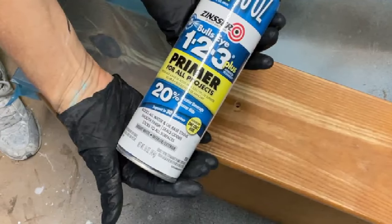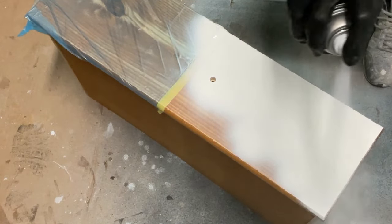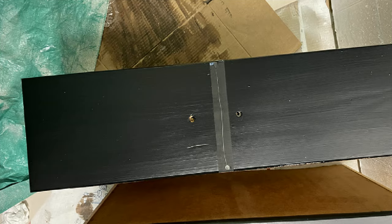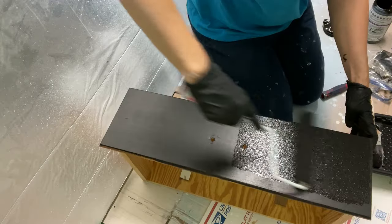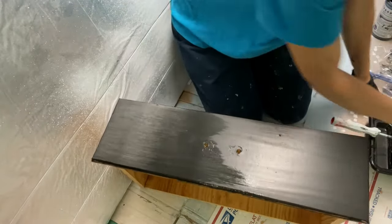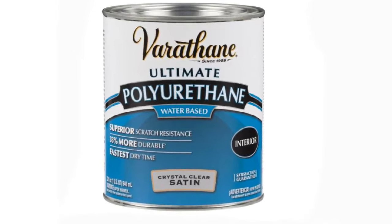Drawer number five was used for the chalk paint. Since Beyond Paint is an all-in-one paint with primer, paint, and sealer, I sprayed an oil-based primer on one side of drawer number five. I didn't apply primer to the second side so I could see if primer had an impact on the durability of the chalk paint. After the primer dried, I painted undiluted chalk paint on both sides of drawer five using a synthetic bristle brush. The chalk paint had good coverage with visible brush marks. A second coat of paint was applied to all five drawers, and then I applied two coats of polyurethane sealer to drawer number five with the chalk paint. Since Beyond Paint already had a built-in top coat, this step wasn't necessary for the four drawers with Beyond Paint. I then allowed the paint to cure for a full 60 days before testing — twice as long as Beyond Paint's recommended 30-day cure time.